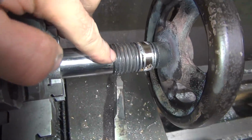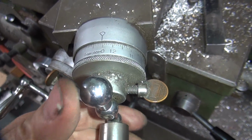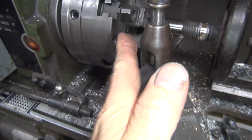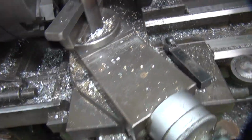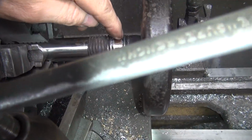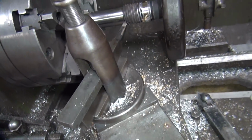Yep, I am cutting on that side. So I'm going to change this to 0 now. And we'll have to back this number off a little bit because this one's feeding in this way. So if this one feeds in, you can't have this as deep or it'll cut the line. Okay, so it looks like we're cutting the correct thread when we're way over here. I want to see if I can catch that thread right over here and make sure that one lines up correctly.